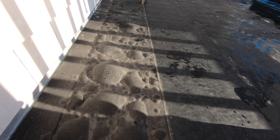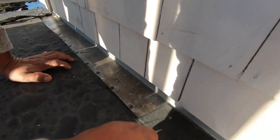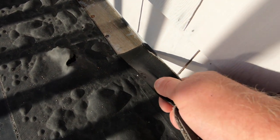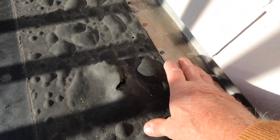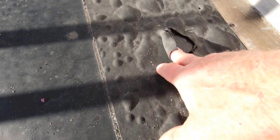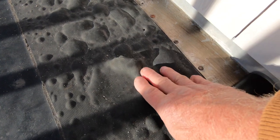What happens is the EPDM has a glue. Let me show you the glue — we just took this off, peeled it up, and you can see we cut this open already. The heat breaks down the glue and that's what starts going wrong on these EPDM roofs — the transition between the metal or flashing to the membrane. These tapes fail because they're not the same quality material as the roof itself. This is uncured rubber and this is cured rubber. The uncured rubber is what they use to make the transitions — they call it cover tape. And the glue is what fails on these tapes.